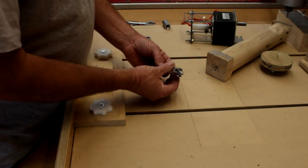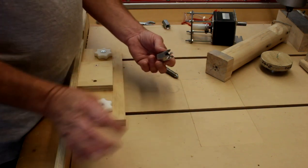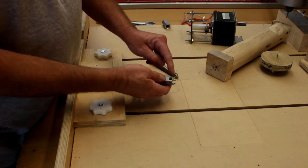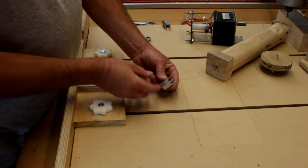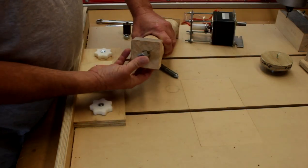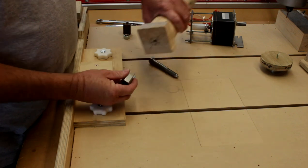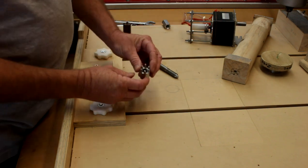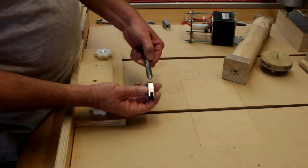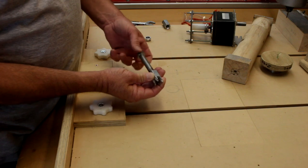This is what I finally came up with — somewhat of a medieval-looking device. It started out as a coupling nut. I drilled some holes around the edge, drilled a quarter-inch hole on each flat, then with a hacksaw cut down and filed and made a point. The advantage is you can hammer it right into the wood and no matter which direction you turn it, it will not release. The challenge then is aligning it with the center of your material — the answer is this bolt here with a point on it, which I sharpened on the grinder.